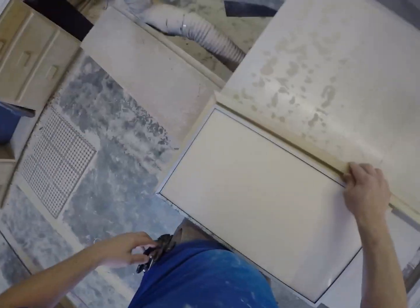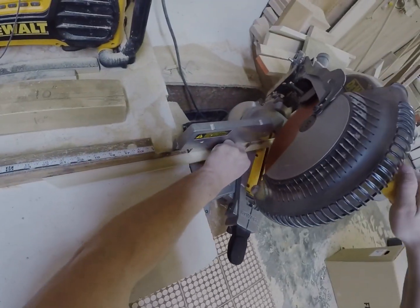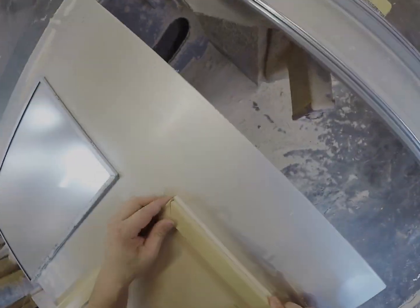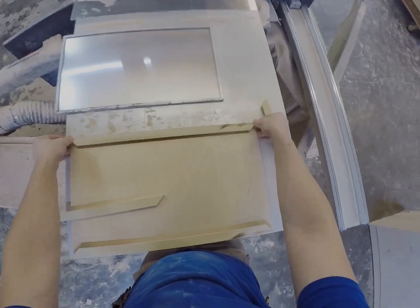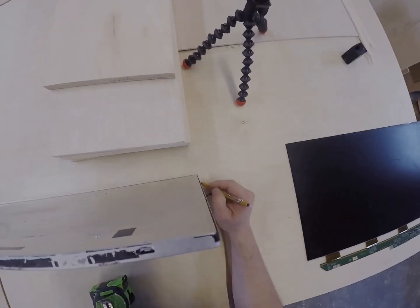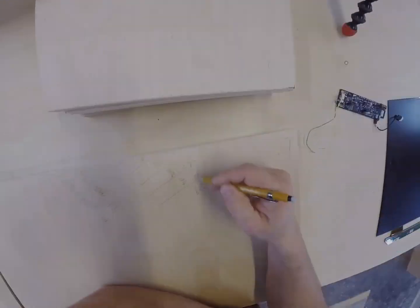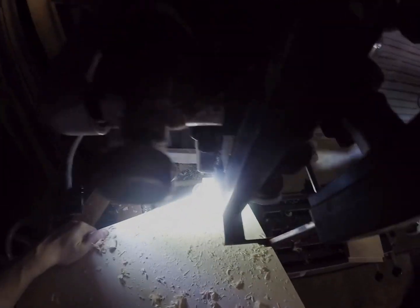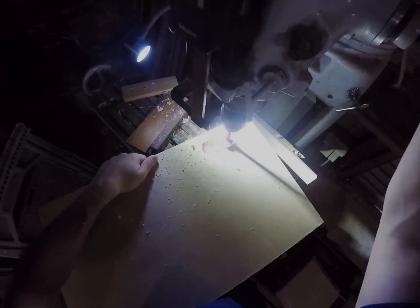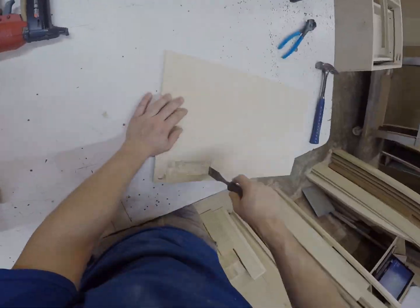Next, I cut the pieces of the frame at 45-degree angles, but a bit lengthier than their final sizes so I could sneak up on the right fit later. Before finalizing and attaching the bezel, I measured out a spot for the electronics and hogged out an opening for them to reside in. As a show of solidarity to my other bad moves, I made that opening just shallow enough that the electronics would not fully sit below the plane of the opening. Good work.